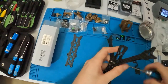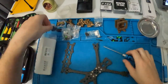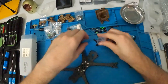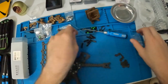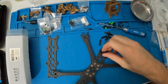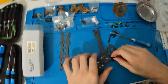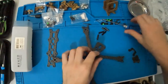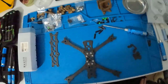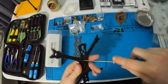Once you start to see the screw poking through, that's a good sign. Take your standoffs and for the Siren F5 split, every standoff is the same length except for two of them which go in the front — we'll cover that later. Grab any of the other ones and twist it onto that long screw you just put in, then come back to the other side. Now that we have all four standoffs in, go back and make sure these four screws are tight.